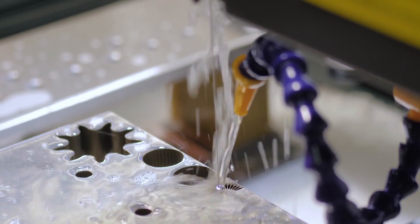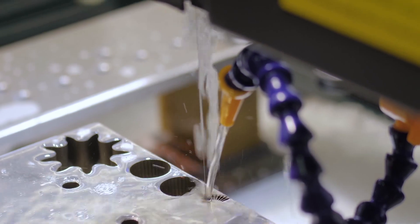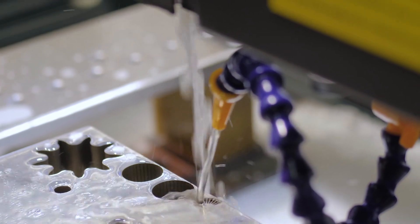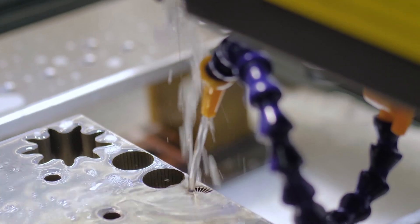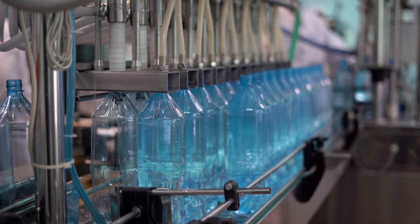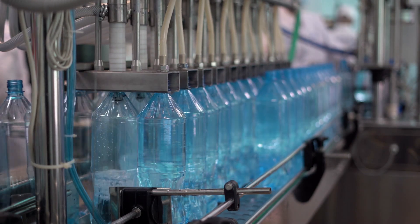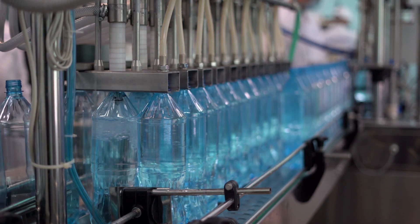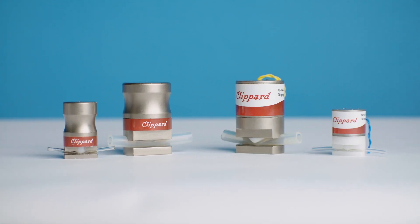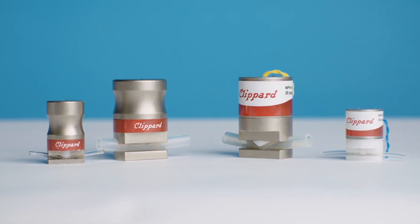And now it really becomes all application specific. If my application is controlling the flow of water as a coolant in a machine, then I am not going to be too sensitive about the quality of the water or any certifications for water use. If my application is dispensing water that a person is going to consume, I am going to be highly concerned with the quality of that water. Therefore, I would not want to use a valve which could potentially introduce contamination. I would likely resort to a valve with NSF or FDA approved wetted materials such as a pinch valve.